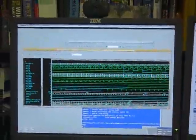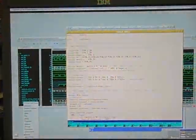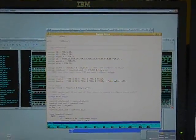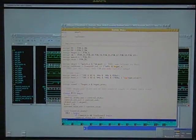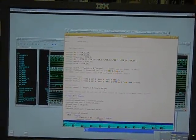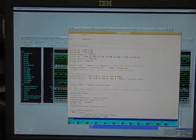Once I've gotten this far, the next step is to go ahead and start working on my implementation of the custom. I have a file here for the 4-series which I'm currently working on. This is written in a hardware description language called Verilog — there's also VHDL — which allows me to describe the architecture of the custom in a high-level language: registers, AND gates, OR gates, inverters, and all sorts of stuff. Once I've done that I can program it into my chip and run it on the actual board, but that takes a while. What I'd really like to do is stay in software mode and keep iterating until I know I've got it right, then burn it into the board.